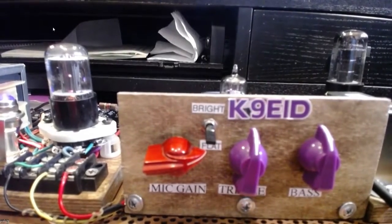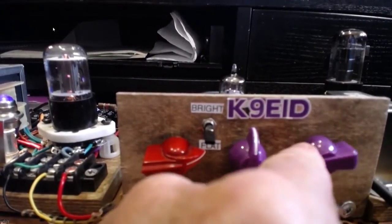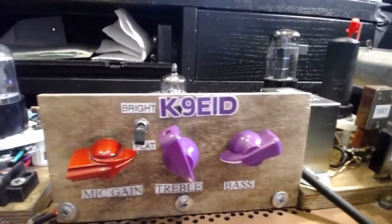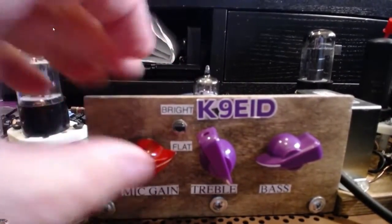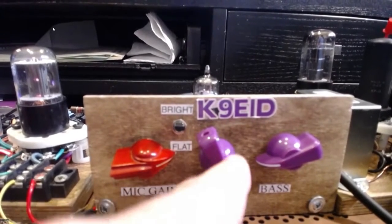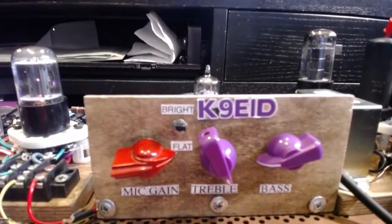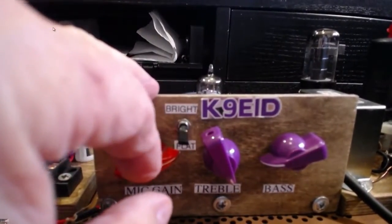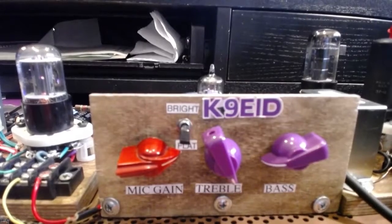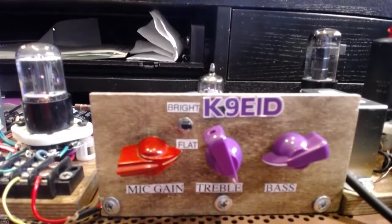But they don't understand — there's a lot to say about your ears. And I learned it as a young guy from Paul Klipsch. Bring up that treble. But let's do this special little bright switch. Oh buddy, it's in your face. And again, I'm not changing level. What's changing is your ears, because I'm bringing the frequency of about 2200 to 2800 Hz up by about 8 dB. If I take it out of there, it might actually show more output on the meter, but it isn't the kind of equalization we need.